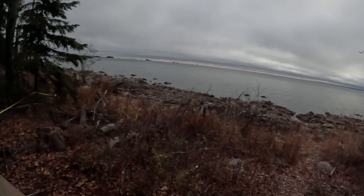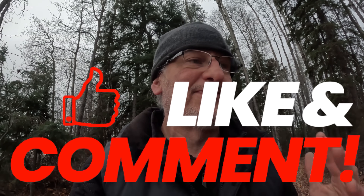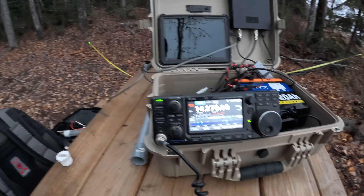I'm using this and testing it out in the beautiful Saskatchewan northern landscape. You want something out there that's going to do it. You can measure voltage, check for AC ripple in your shack. AC ripple is an AC waveform going into the DC — keep it simple, there are lots of videos on it. For the average person, you don't want AC ripple in your DC power supply because that AC ripple is going to cause noise. Now listen to this — there's no noise here. Isn't that cool?